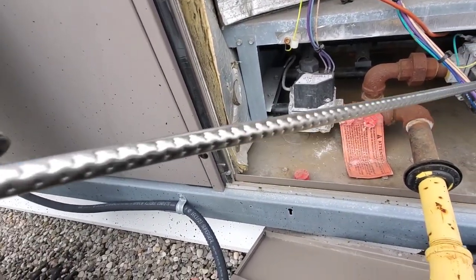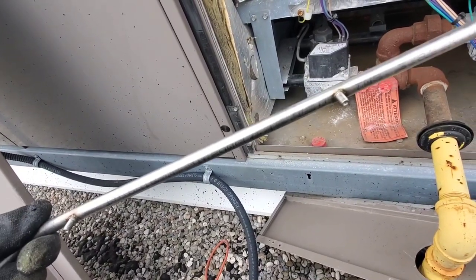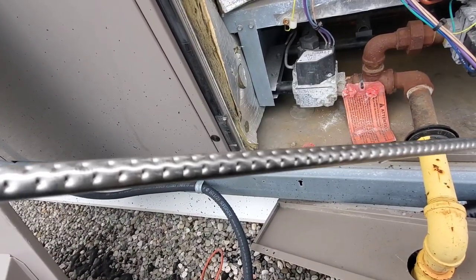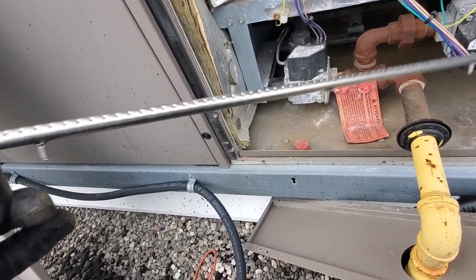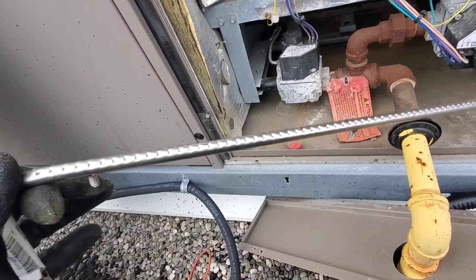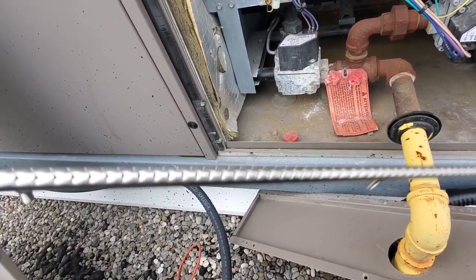What can happen is these holes are really, really fine and small. If the pilot tube gets some stuff inside of it and starts blocking up these holes, it can cause an issue. You can take them out, blow them out, clean them — but if you're going to take it out, you might as well just get a new tube and stick it in, because it's going to help the longevity of the machine and you don't want callbacks in the middle of the wintertime.